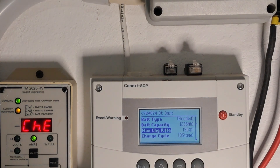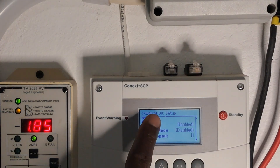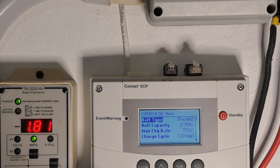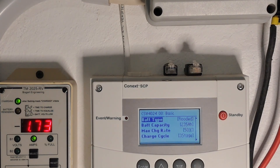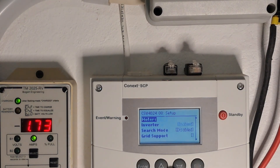Going back up to 50 here — you'll see it take effect in unit zero-zero as well, since this is the slave. It's configured to copy settings from one inverter to the other. Back to 50 percent, enter. You can hear the generator in the background — it's a petrol generator, very loud. Let's go back out and verify the 50 percent in the master inverter under basic settings. That demonstrates that both inverters are working together to charge the battery.